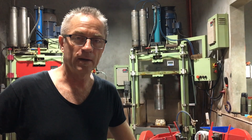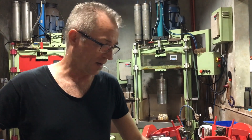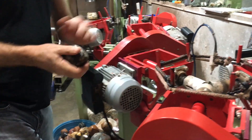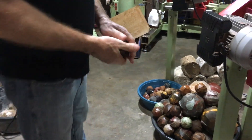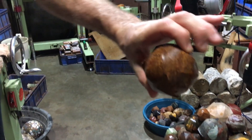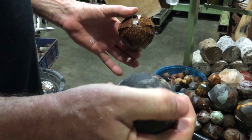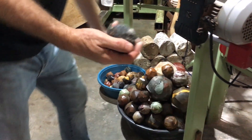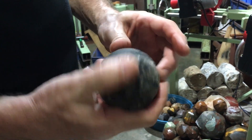Hi, I'm John Roland with Highland Park Lapidary and I'm going to show you a little bit about sphere grinding. Today, basically what we're going to do is I've got a piece of palm wood — this is Burmese palm wood. What we start with is a core drill preform that looks pretty much like this, and then we do some real quick hand grinding with one of our wet grinders to knock all those corners off, which is maybe five minutes of work to get it round. You can see you're starting with a really good preform.